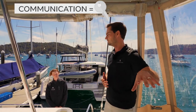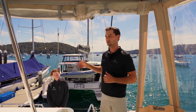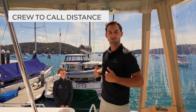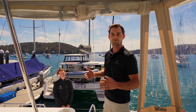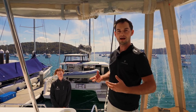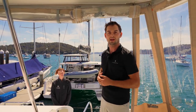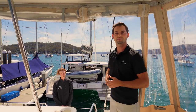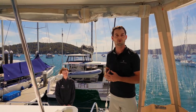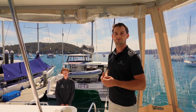Communication when you're completing this manoeuvre is quite essential. I'm going to be positioned at the helm station driving the boat and Ben will move around the boat — dropping the anchor first, then making his way to the aft section. Ben is going to be calling my distance: five, four, three, two, one metres as we come in so I know how far I am off the dock. On this Lagoon 46, the model has stern cameras optioned, so I've got a camera looking out the back on the chart plotter. As well as listening to Ben, I can see him and see the distance to the back of the boat from the dock. If you don't have a camera, that's not a problem — it's just about that clear communication.